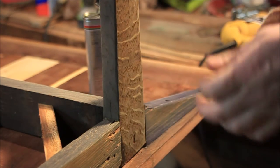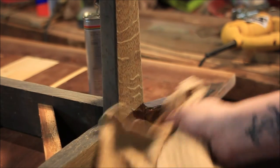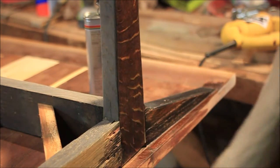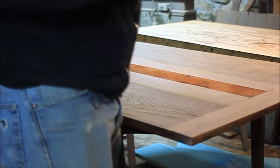I decided to finish the underside with satin wipe-on poly because it would really darken it up and make a nice contrast with the brown top. And look at that white oak — those rays there, those weird squiggly lines, those are called rays and they look sweet. This is what the finished look looks like with my poor shop lighting on the underside — a nice, real light-absorbing look. It highlights the form of the piece without being too fancy.